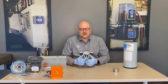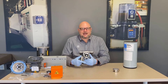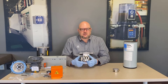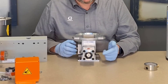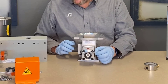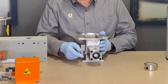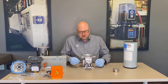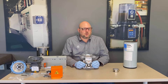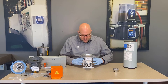On the bottom, this quarter-inch port is normally where people install the relief valve — just like on a G series pump, the relief valve is sold separately. It's a safety device, so make sure you get your relief valve and install it into the port down here. The valve choice depends on the application. Either side can be used as the outlet; most commonly the side on my left is used, since all the rest of the mechanism is off to that side. You do have the flexibility of using either one, but make sure you plug the one you don't use — if you try to use both, the fluid will take the path of least resistance.